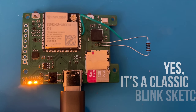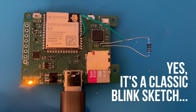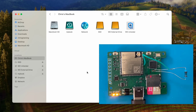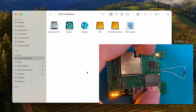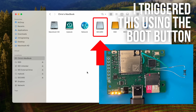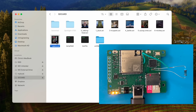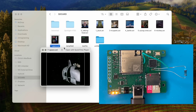And hey presto, the ESP32 sprang into life. I then tested out switching over from the ESP32 to the USB 2244. I changed the two USB pins on the ESP32 to input, and enabled the USB 2244 by taking GPIO39 high. And amazingly, my board transformed into a high-speed SD card. My proof of concept works. We can share the USB bus between the two chips and switch between them. All it took is one bodge resistor.